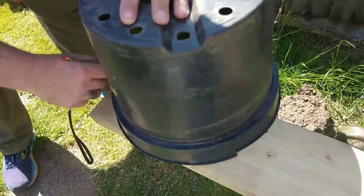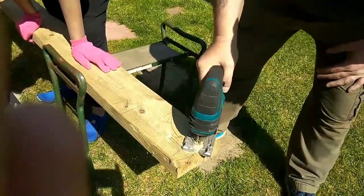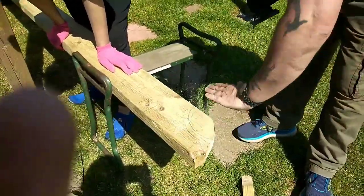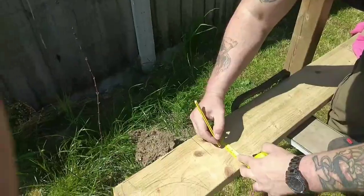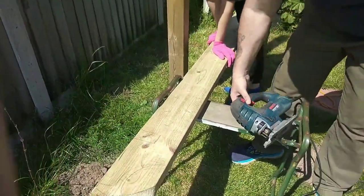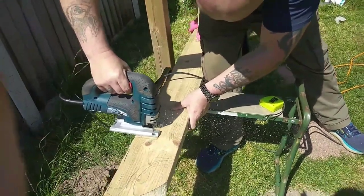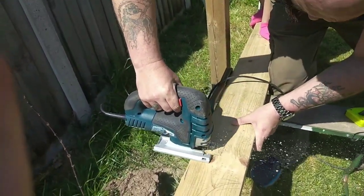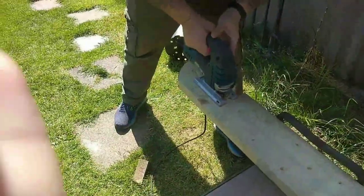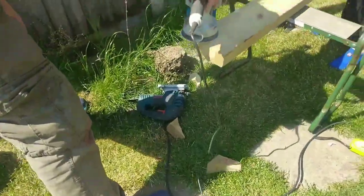It took us a while to design the ends, and in the end I just used a big old plant pot just to draw a curve. I'm going to cut that off just to give it a better look. Now, I'm going to measure down exactly halfway and mark it for the cross-halving cut. It's much easier if you sand all your markings, your pencil work, and the rough edges before you assemble it.